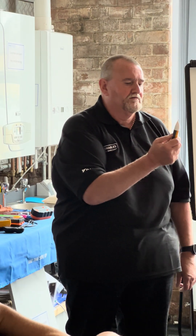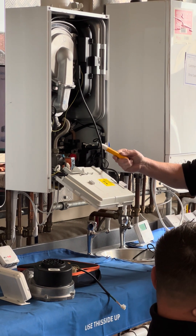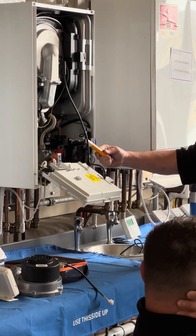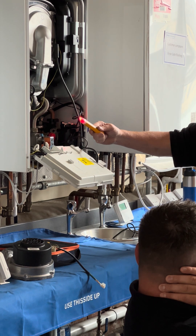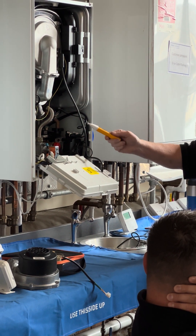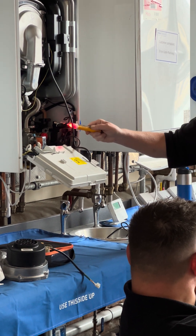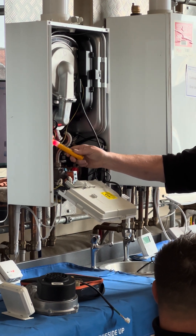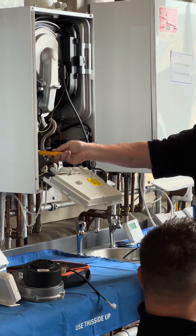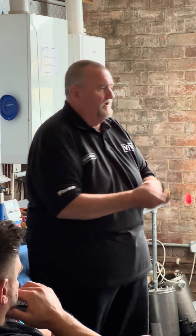So that's where the other device comes in — turn it on and prove it. If I put that onto the wire going to the pump and nothing's happening, it might be that the live conductor is at the front so I need to move it around. When using one of these to check power going to a piece of three-core flex, always move it around until it comes on. Going to the fan — yes, I've got power going to the fan and to my diverter motor. So I can prove very quickly, without getting a multimeter out, whether I've got power going somewhere.